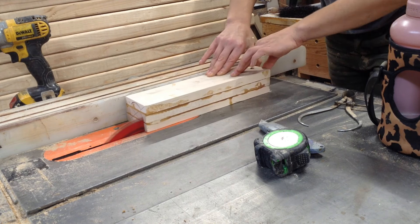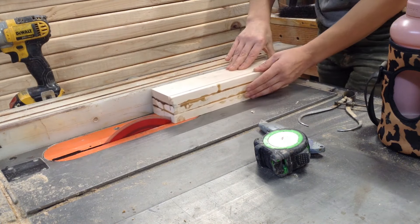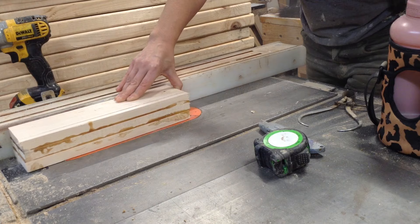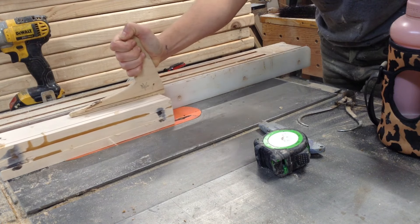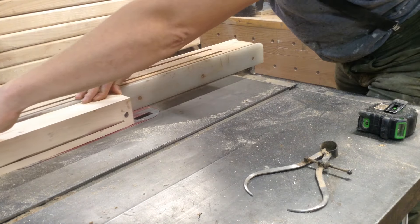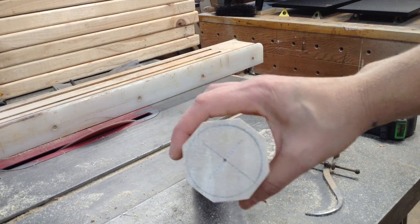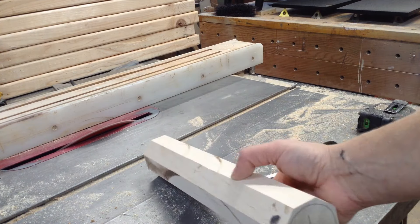I drew my center points and circles on both ends. It's easier to do this when the piece is square, and then I could clean up my edges. You want to glue this together fairly flat so that sending it through the table saw against the fence is not a dangerous cut. Some people will start turning at this point, but I like to add some 45s to it. I consider myself a novice turner, so the less material I have to remove the better. These little 45s off the corners get me pretty close to the diameter I need for the center, which is the thickest part of the piece before it tapers out.